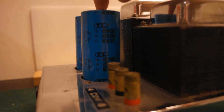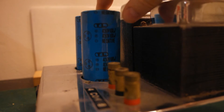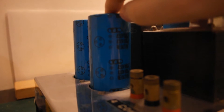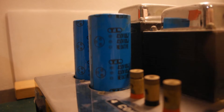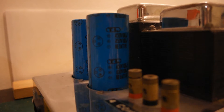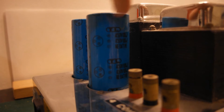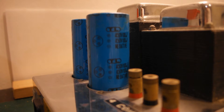Interestingly, the very large capacitors here — 450 volt, 100 microfarad — appear to be dual capacitors, as in we actually have two capacitors in one. You can see: minus, plus, plus. These are quite large for only being 100 microfarad at 450 volts, so they're probably pretty old. I think I'm going to do a test on these just to see if they're okay.